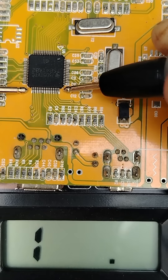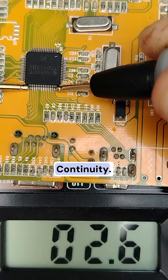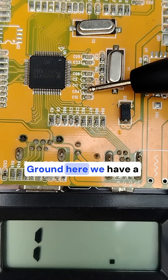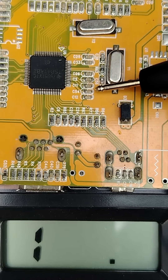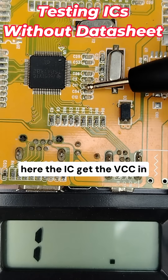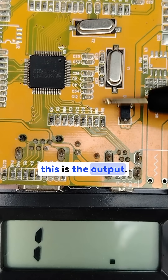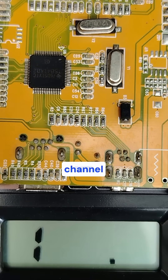Because this pin is connected to this wide area, and this pin is also connected to this wide area — continuity, ground. This one is also ground. Here we have a bold line: this pin is connected to this bold line and then connected to the ceramic capacitor, which means here the IC gets the VCC. The ceramic capacitor and those thin lines — basically, this is the output. If you want more videos like this, subscribe to my channel and be ready to be impressed.